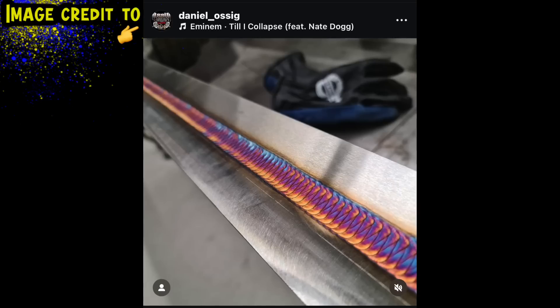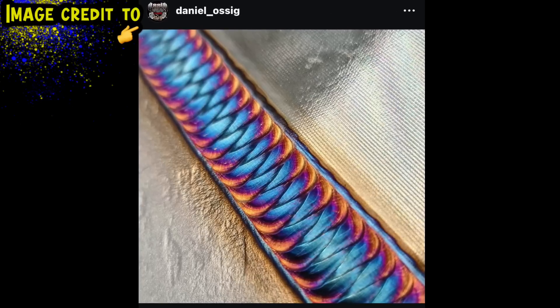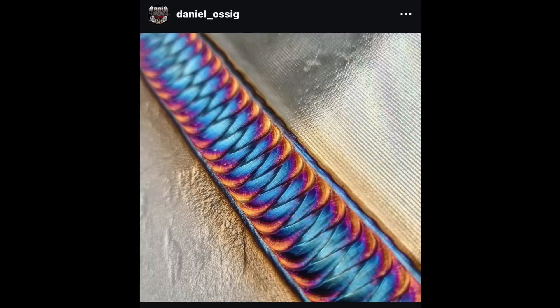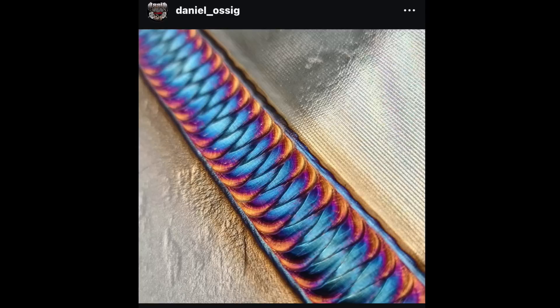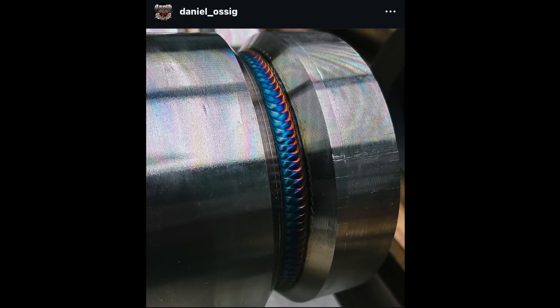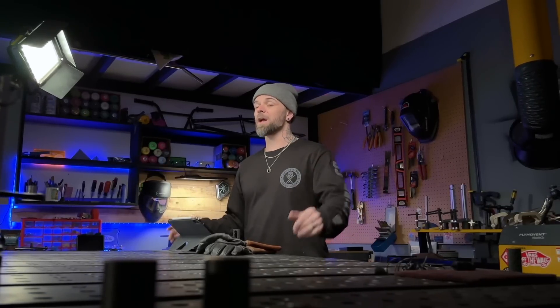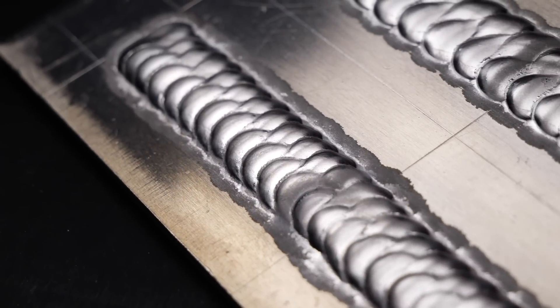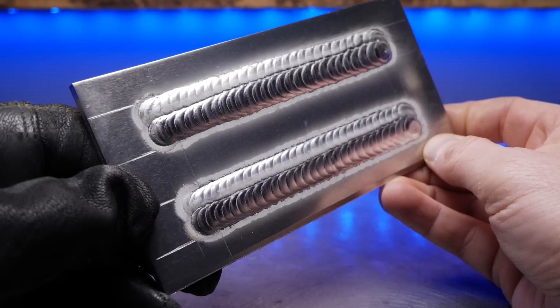You see super great weaving on steels with cup walking — I love it. Here are the reasons why I'd be fine with those passes: the stepping is nice and tight as it progresses along the welding pass with no super wide gaps between each puddle, and these are typically always fill passes or caps that go over a proper root underneath. Here's a photo from around 2012 when I went to welding school — I was doing a fill pass over a root with a lot of joint left to fill. I freehanded it with no cup walking. No shade at all at cup walking, I just don't want to scratch my aluminum and I prefer to freehand. After doing this professionally for years, I'm either going to use this square pattern to keep things nice and tight, or do it with a split weave pass as I prefer.